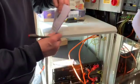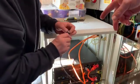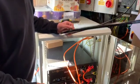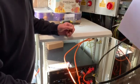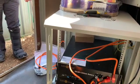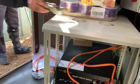On the bottom one you can see switches one and two are both up. This is quite important. The next thing is the other communication cables - two ends to the cable. One says BMS, so that side is the battery side, and that side is the inverter side. This needs to be routed to the inverter and plugged into the inverter. This side goes into the battery. No alarm - right - so that means if you switch the two batteries on with no alarm, the batteries should be talking to each other.